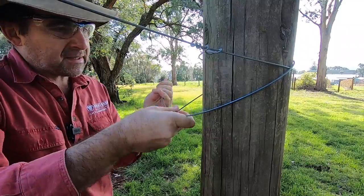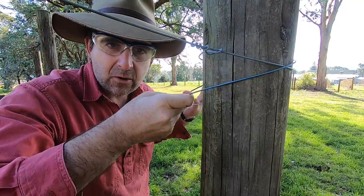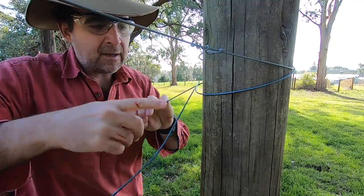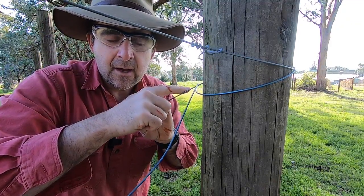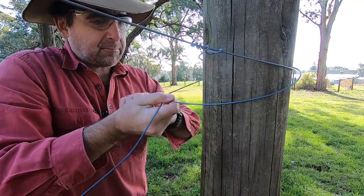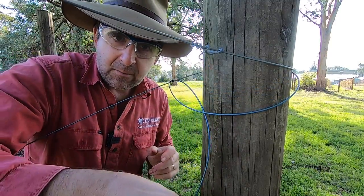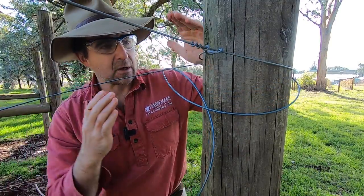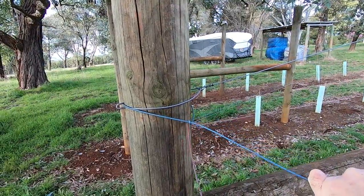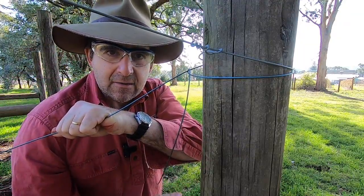Once I've got that in place, I'm going to cross them over, leaving about 30cm of offcut that I'm going to be tying my knot with. When I've got it in that position, I simply fold it over into a horseshoe. Now I'm not going to cross over this wire again for a while. The next thing I'm going to do is pull this wire out a little bit so that I can tuck my offcut through the hole I just made. Now I'm going to use my post as a guide for tying this knot, so the next thing I'm going to do is pull this knot in nice and close and pull my offcut so that it goes straight down the post.